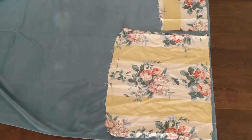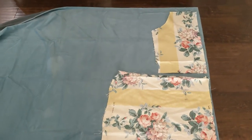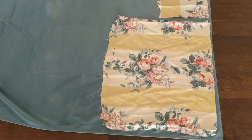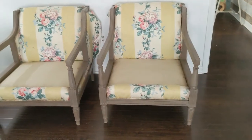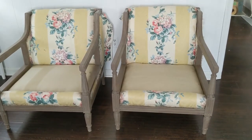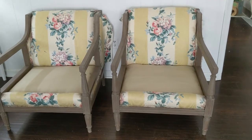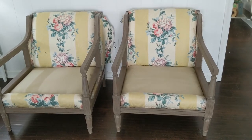The first thing I'm going to start doing is laying out the pieces I took off the chair earlier and cutting my fabric. When you're ready to start cutting, it's a bit like figuring out a puzzle because you want to waste as little fabric as possible — you mostly want to lay and cut the biggest pieces first and fit the smaller pieces around them. But you also have to be careful because some fabric I didn't take off the chair, and the back is a really big piece, plus I haven't done the cushion yet. So I need to make sure I leave enough big fabric for those parts, and I'm going to cut some fabric for that back before I do anything else.